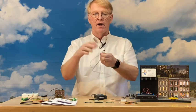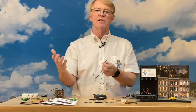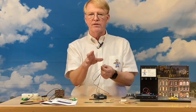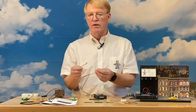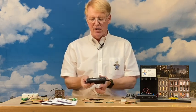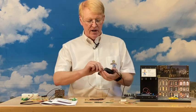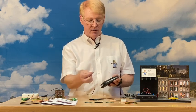We make and sell a kit that includes an LED chip. You can have four different LED colors: 2000K, 3000K, 5000K, and 6500K — all representing Kelvin color temperature. 2000K is a yellow candle color, 3000K is a normal light bulb, 5000K is a little brighter, and 6500K is very blue and fluorescent. They use the same plug as Woodland Scenics products, and the unit can adjust the brightness of every single port individually.